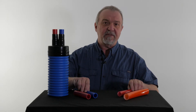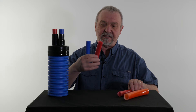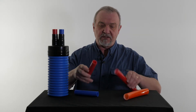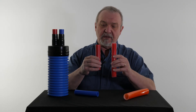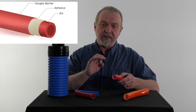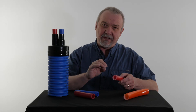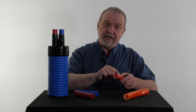If you have an open system, then you'll be fine with potable water PEX, like you see in this red or blue here. You can see the difference between these two. This oxygen barrier has got kind of a shiny coating on it. That shiny coating actually prevents oxygen molecules, which are smaller than the plastic molecules, from going through the wall of the pipe and into the system.